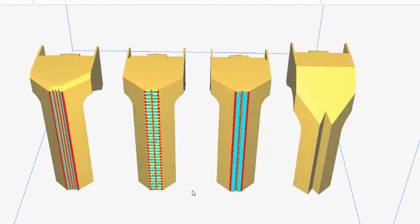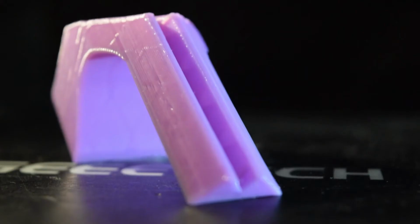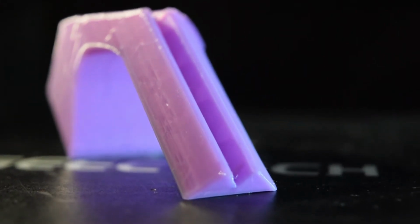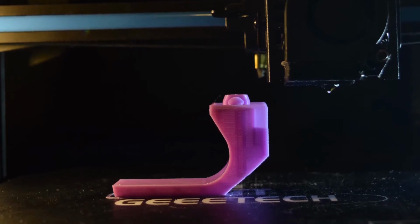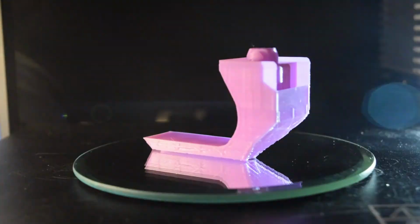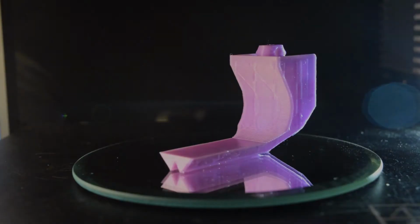Meanwhile, the bottom of the tool was optimized across multiple iterations to have minimal area and maximum fracture characteristics. Finally, this angled corner feature was added because it greatly increased crack propagation during removal. All of these features were added across countless iterations before finally arriving at our final design. This is the tool that we would be using to break away the supports and pluck the cantilever beam.